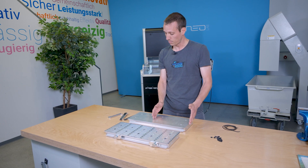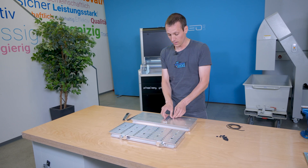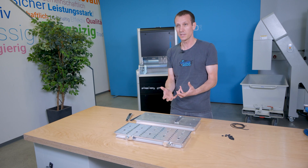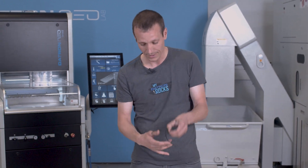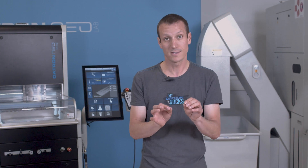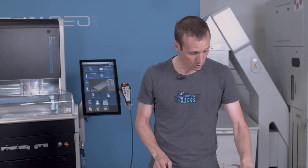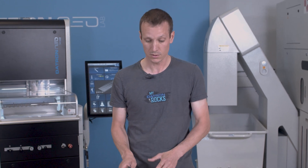On the rest of the plate we're going to make pockets. After we cut it from the first side, we want to put it in place so it gets mechanical stability — it's a negative form with a jig. Then we use rubber gasket to seal the different sections where we have flat areas that can hold the part. An entire vacuum fixture — pretty excited for that. We're also using these little rubber plugs that you know from the standard ones, so we can even activate and deactivate single positions.